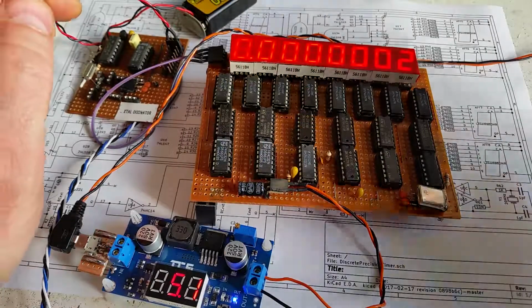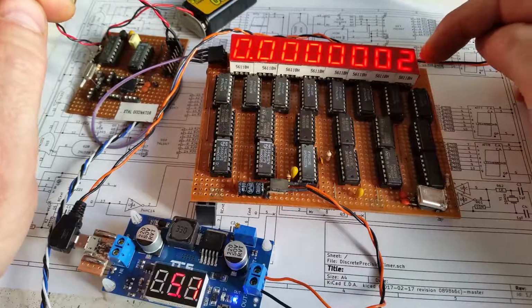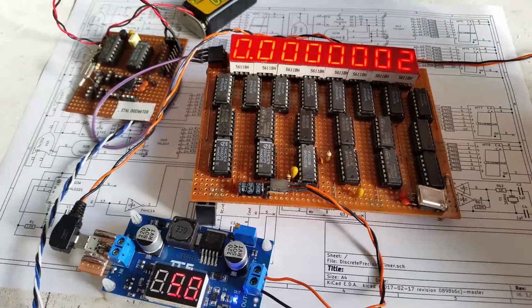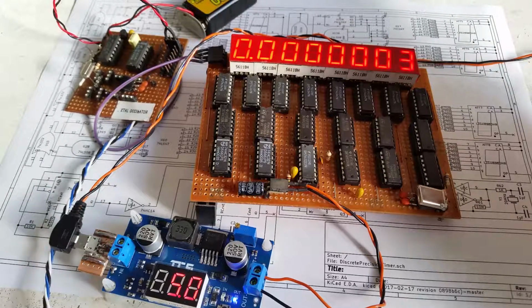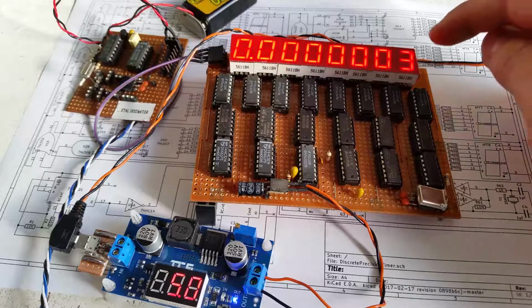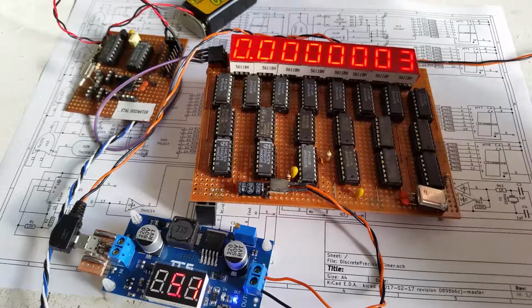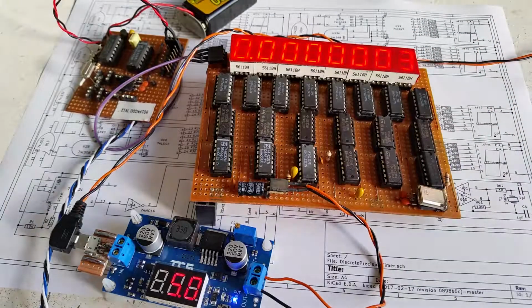And I should be getting a value of about 0.2 here, but 0.25. So it's probably not going to make much difference. But if I reset the timer, so 0.2 still, I'll do it again. 0.3. So it's showing that it's still got the 100 nanosecond error rate, but it's actually counting higher. So this should be 0.2 and then 5 afterwards. So that's looking good at the minute.